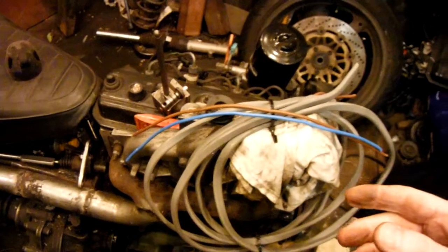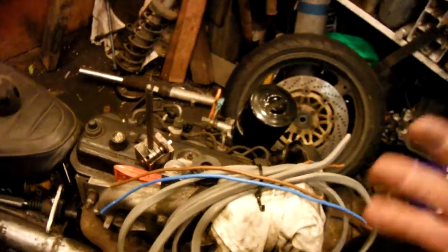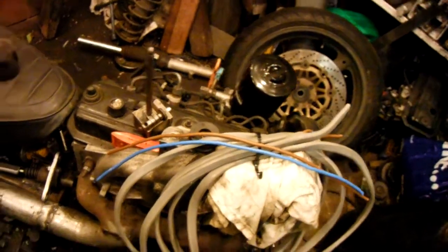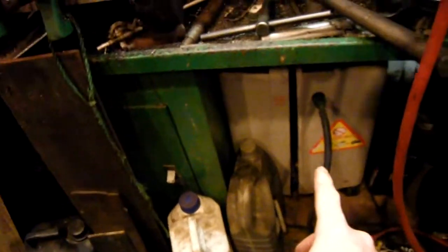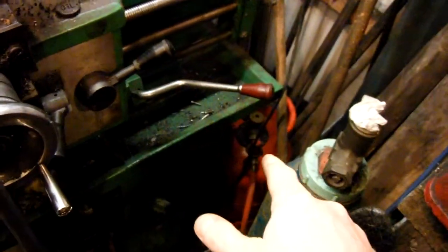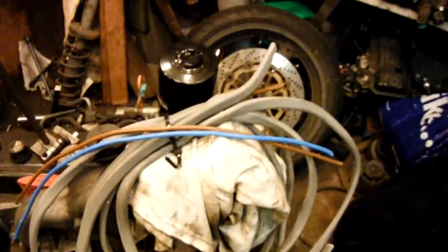Today's experiment is brazing, and normal brazing rods are quite expensive. I've seen guys on YouTube brazing with copper as a filler instead of brass, with mixed results, but they've been using MAP gas which is not as hot as oxypropane. What I have is oxygen coming out of this machine here, which is a hospital-grade medical oxygen generator for people with lung problems that produces medical grade oxygen. I've got propane in a bottle.